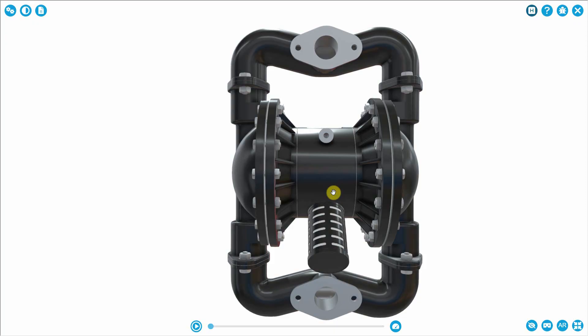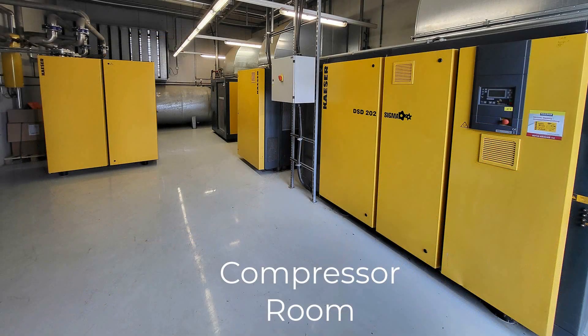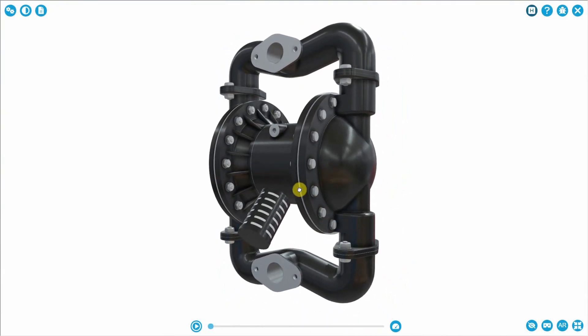The compressed air is going to be at around six, seven, or eight bar pressure — that's about 80, 90, or 100 PSI, somewhere around there. That's typically what you'll have for service air. The air that comes out of the compressors is discharged around the industrial plant, or maybe just from a compressor directly to the pump. Six, seven, eight bar is pretty standard. The compressed air is what drives this pump — it's what causes it to pump.